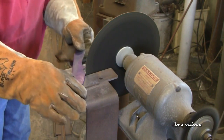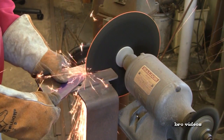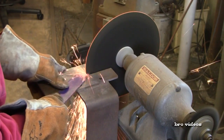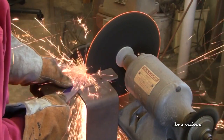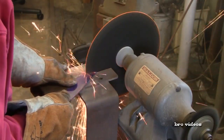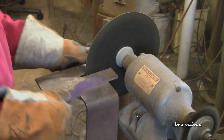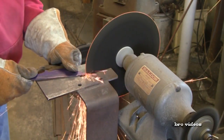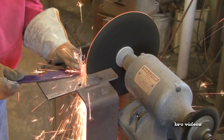You can take it slow and easy and I never compromise that abrasive wheel — I don't put it in a bind of any kind. That wheel is marked; it'll go actually up to probably about three times as fast as it's going. This is a 1,700 RPM buffer and I think it'll go up to 5,400 RPM. It's a high speed wheel but I've got it on a low speed buffer.